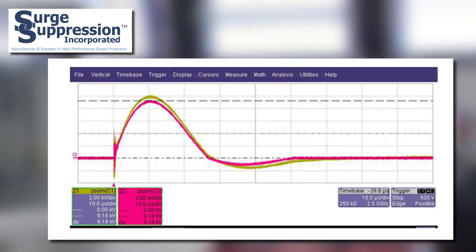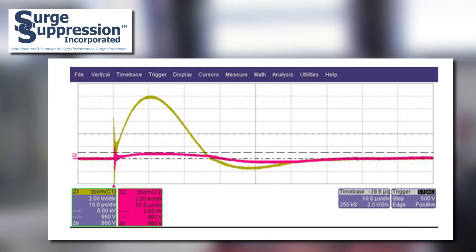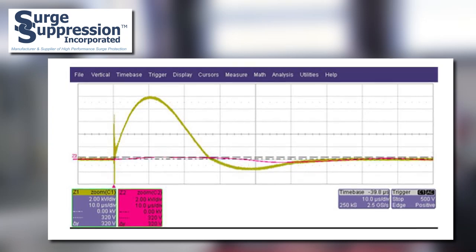So there are many options when it comes to actual installation and application. It is always suggested to place them as close as possible to the load intended to be protected. When the series connected SPDs are combined with the panel mounted SPDs, the resulting surge current can be reduced as much as 90 percent at each level of protection. This is referred to as a cascaded protection approach. Using this cascaded protection approach, the surge current reaching the sensitive and critical equipment being protected is often so small it is insignificant and prevents damage to the now protected equipment.